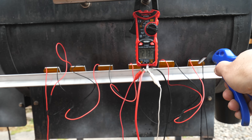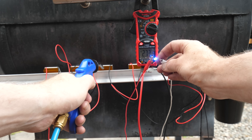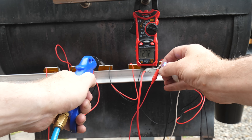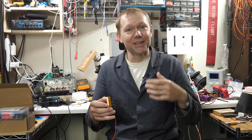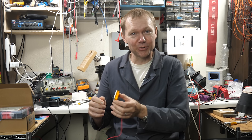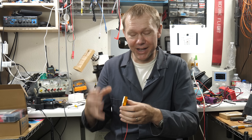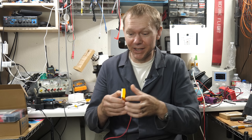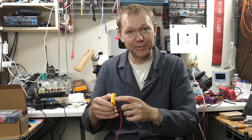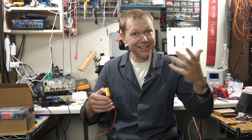On a hunch, I grab my air compressor and start sending air across the heat sinks. Looks like we have our answer. These things operate on what we call the Seebeck effect, which basically says that electrons will follow the flow of heat. The problem is, not long after you attach these things to a hot grill, the heat sink side — that's supposed to be the cool side — is hot to the touch. So you've got hot on one side and not quite as hot on the other; you're not going to get a lot of flow of heat unless there's some way for that heat to dissipate off of the heat sink. Hence why when I grabbed the air compressor and started blowing air across it, all of a sudden the LED lit up.